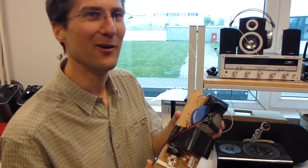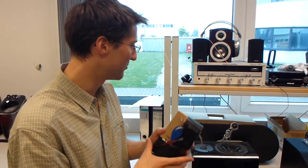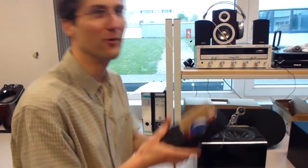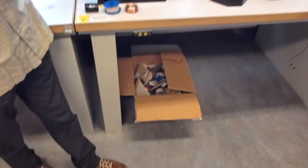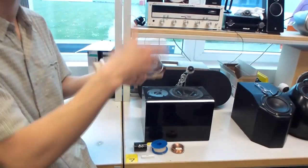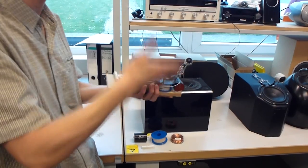Here is an example of the really handmade crossover filter. This is the piece of electronics responsible for addressing the right part of the sound to the woofer and the other part to the tweeter. We can play around with those components — we have a toolbox of them — to fine tune. We build and listen again and build and listen again and measure, to understand what we're doing and evaluate it.